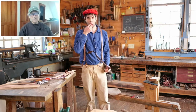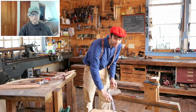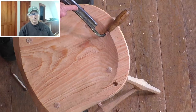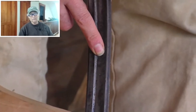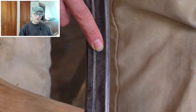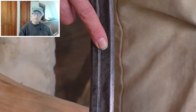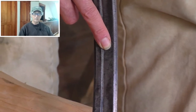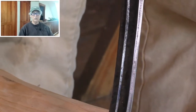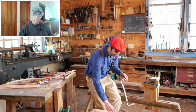One of the reasons is — especially if you had a short bevel on that draw knife, it's much harder to control. It's going to go up and down and look real crappy. Alia's bevel is kind of medium size — not extra short, but not real long either. It's about three-sixteenths or so, which is pretty small. Alia has used it a lot and has good control, but that's difficult for somebody who hasn't used the draw knife much. It'll be easier if you flip it over and track on that back — maybe get a piece of wood and practice it first to make sure it's not going to dive down on you.